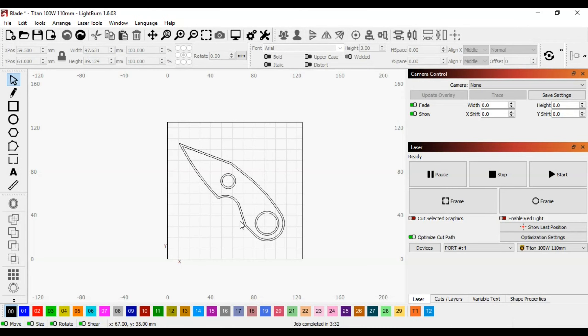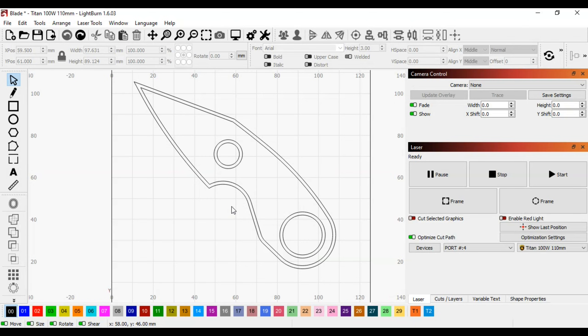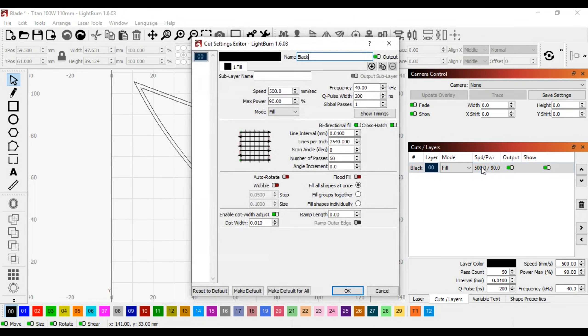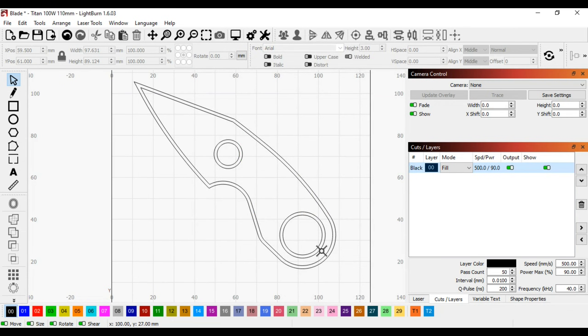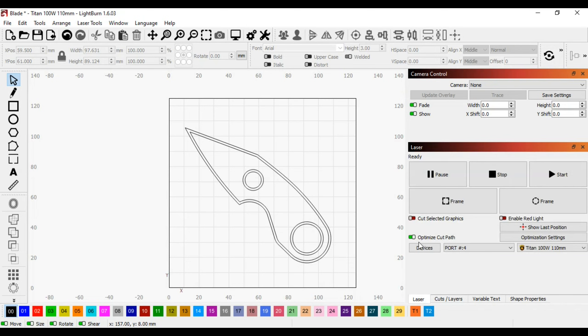This was a last-minute decision and I didn't have the right steel to do it properly, but I wanted to show off its cutting power by cutting out a custom box cutter blank. To start, I set up the blade profile in LightBurn and used the offset tool to create an outline spaced one and a half millimeters away from it. Then I set these to fill mode, so instead of cutting one thin line, it'll cut a one and a half millimeter wide line — similar to deep engraving — straight through the material. This allows it to concentrate more power and heat for better cutting performance.